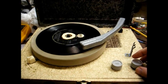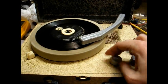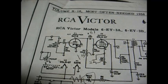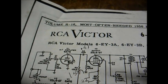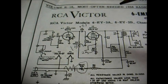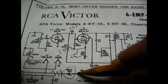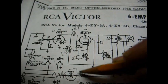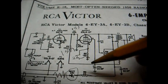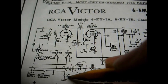As you can hear, that thing is plenty hot. Here's the schematic diagram that was our basis for the conversion — for an RCA Model 6EY3A; you can find this on the Tech Preservation website. The changes I made: I bypassed the 22-ohm resistor and installed a 100-ohm 2-watt resistor ahead of the diode, which got our B-plus voltage down to a reasonable level.